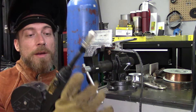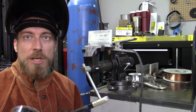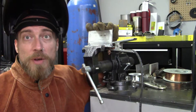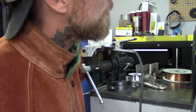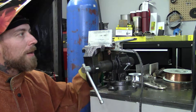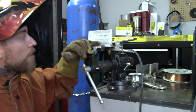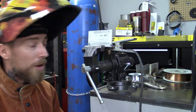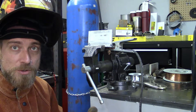So we've got our spool gun ready to go — it's latched down, everything's good, the back is tightened up, and we have our machine switched over to spool gun mode. I was incorrect — this is actually a quarter inch thick aluminum plate, not an eighth of an inch. So we have our voltage at about 55-60%, same with our wire speed, though we don't have to worry about wire speed on the machine because that's controlled on the spool gun itself, set at about 50%. I haven't done spool gun welding in a long time, so let's see if we got it set up right.